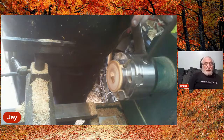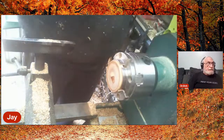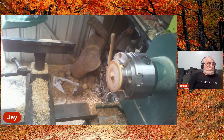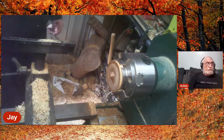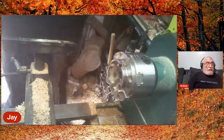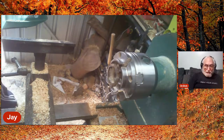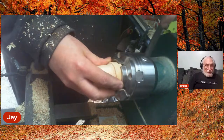Next up is the one decent woodworker saw, and that's what you want. This one was made by Ryobi, and I could most probably get parts from them, but there's one of Robbo's friends that lives in South Australia that used to own a woodworking shop. I'd have better luck asking him, I think. But they're so easy. I mean, they're simple. You can buy a used one, and what I look for is basically, is it too badly rusted that you can't take the rust off and put it together? Because the first thing you do when you buy it is buy new tires for it. And new blade guides.